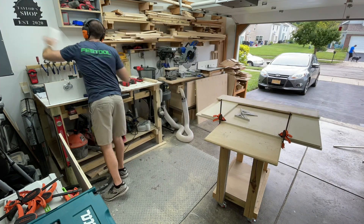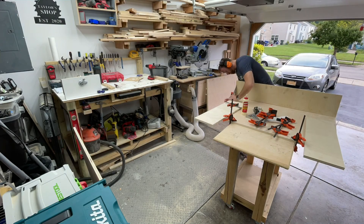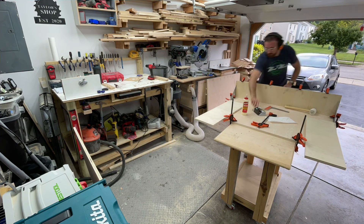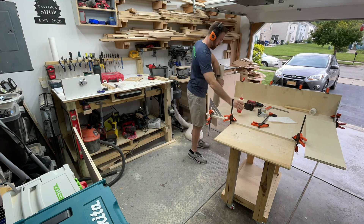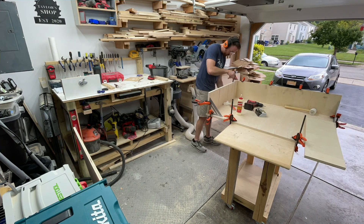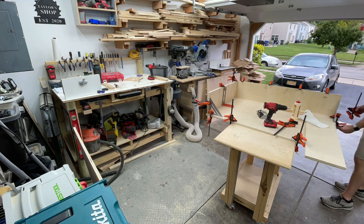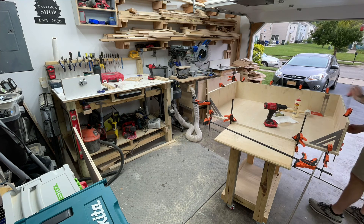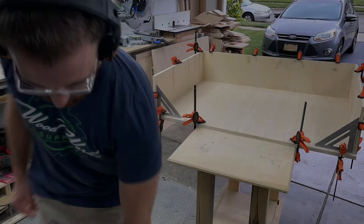This will be the actual glue-up, so you're going to see me use a lot of clamps and right-angle supports. This is Titebond wood glue, some Pony Jorgensen clamps, and I'm using 90-degree metal squares — actually just speed squares, about two or three dollars — clamped in the corners so when I glue and screw it together it's at a perfect 90 degrees. This is super important since it's a box with a drawer inside: if it's not square, the drawer will not slide in and out properly.